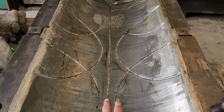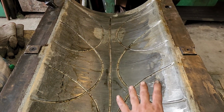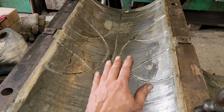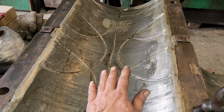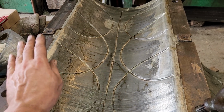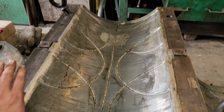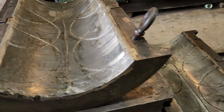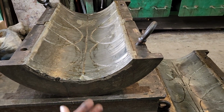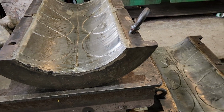Well, if you can get oil in here and fill up all these cracks and crevices and all the little gaps even before it starts turning, it still may be metal on Babbitt contact, but it's going to catch the oil, instead of making basically half a revolution even before it starts sucking the oil in. So that's the principle behind having a pressurized pre-lube to the underside of the journals. Hopefully that'll buy us some time to operate this.